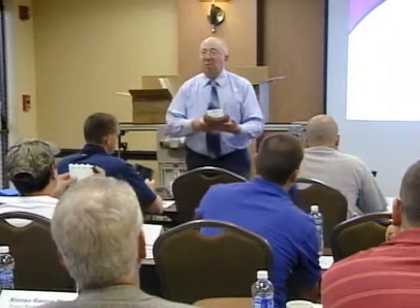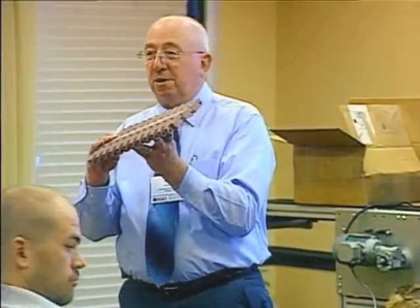And we were talking about accumulation earlier and transfers. They have what they call a raised rib. Raised rib is just what it says. It'll have finger combs that come in here, so when it goes over the transfer plates, it slides right off nice and smooth and there's no gap.